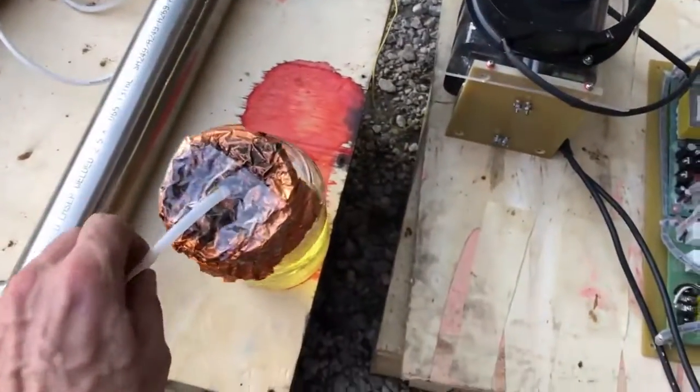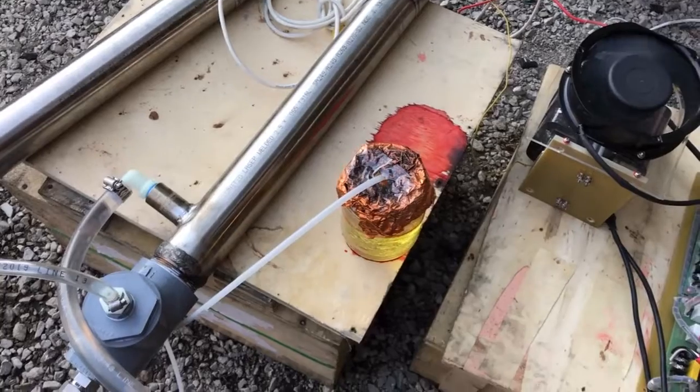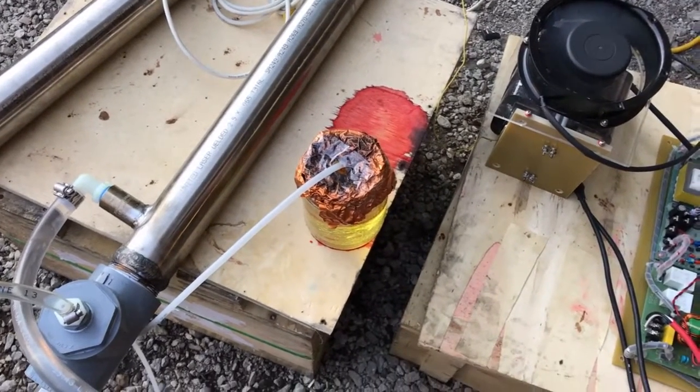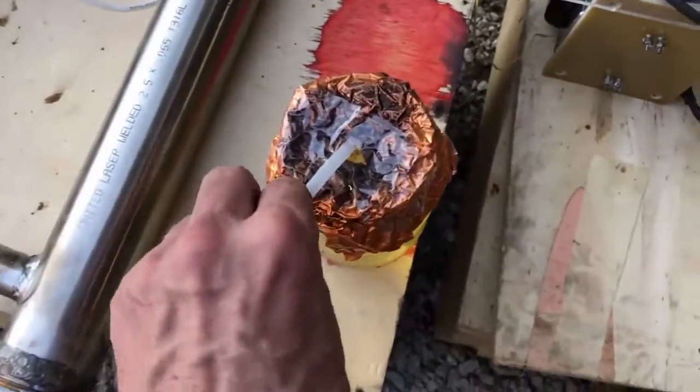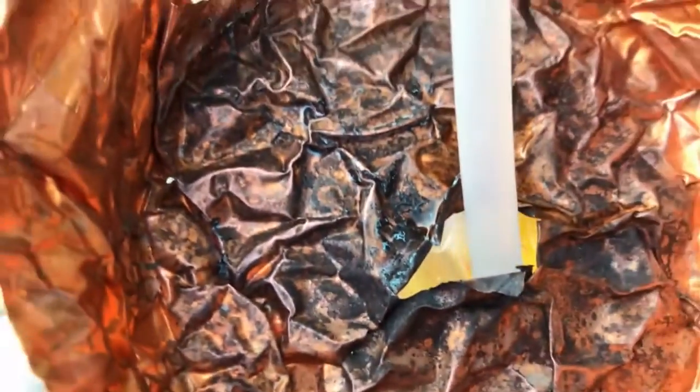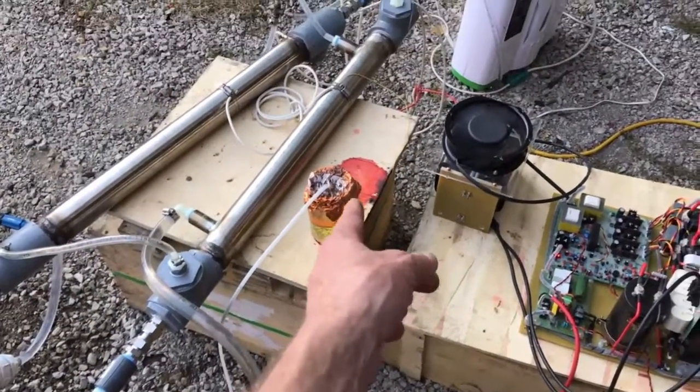I would like to see the copper - oh man, check that out guys, we got green copper this time! In the last test at no point did we ever produce green copper. You can see from the previous test I ran just one cell at five amps, and now I'm running two cells - each one at about five amps. We are contaminating this copper so badly that it's actually turning it green. That is a great sign. It means the ozone concentration is extremely high, and that's exactly what we want to see. That's why I put the copper on there as a secondary litmus test.